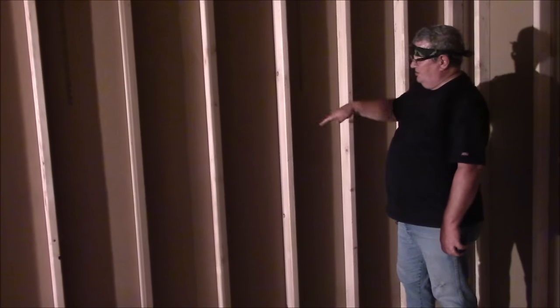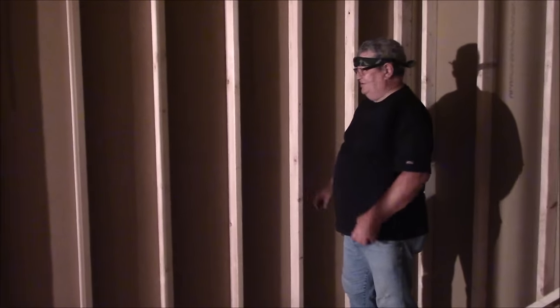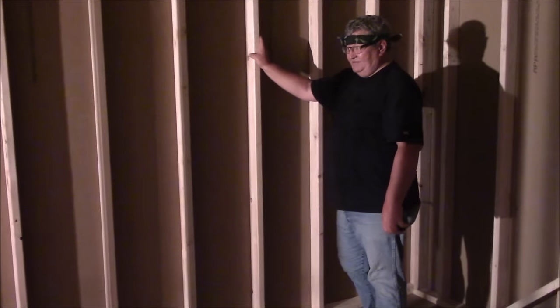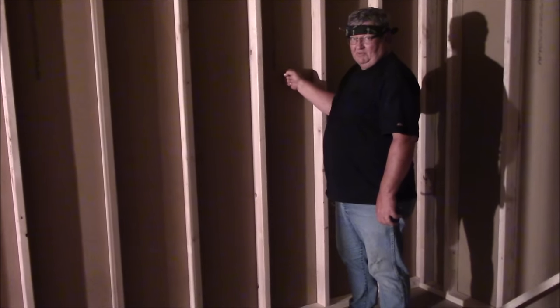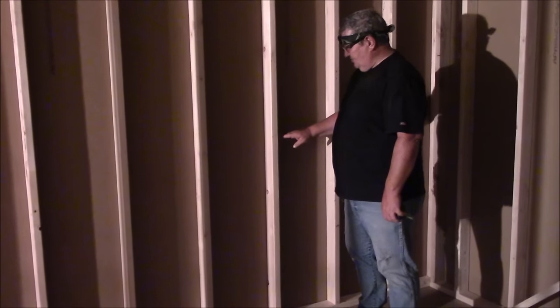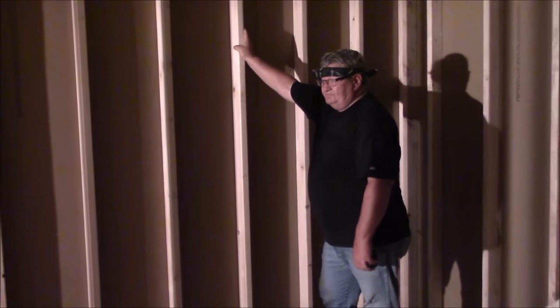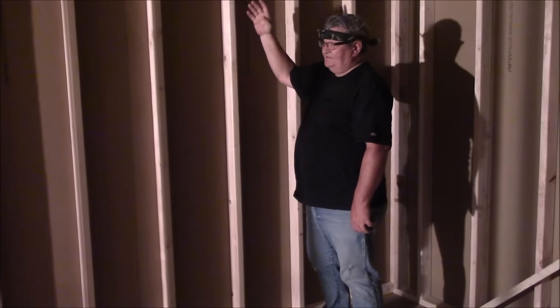Now I will leave a 54-inch opening up and down, because at least I can move it a little bit by leaving enough of a gap top and bottom. And I can fill that in with the expanding foam insulation. So the plan now is to cut this out. I can't cut the wallboard yet. The outside wallboard can't be cut yet, because otherwise I'm going to wind up cutting it below the plate and below the header, and then you'll see it from the outside.